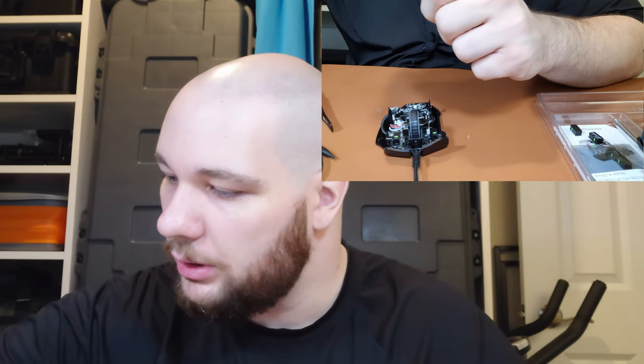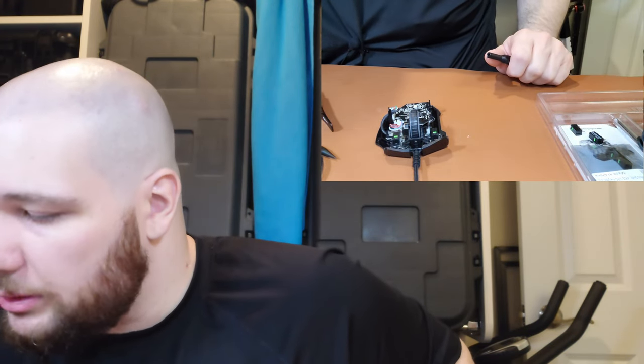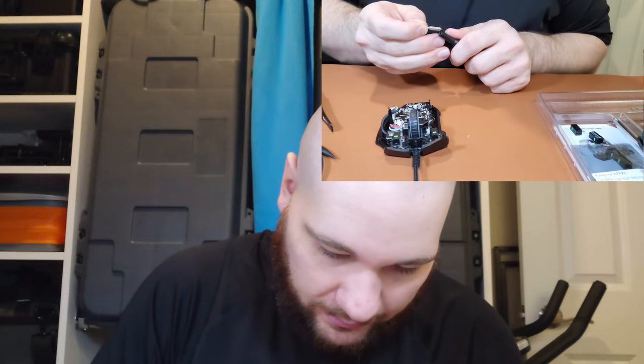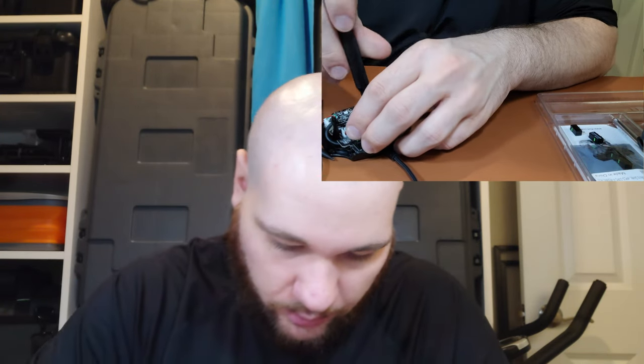Remove one 4mm black Phillips screw from the left side of the mouse holding the screw. Okay. It says it is a 000, so tiny, tiny little thing. They want me to pull it off from the left there, then pull the LED controller board upward and out. Okay. Where's the LED controller board?